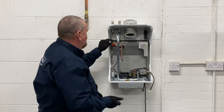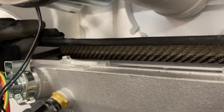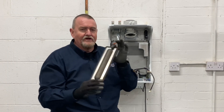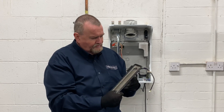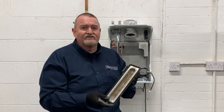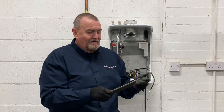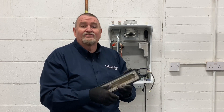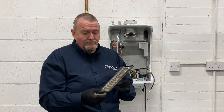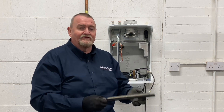The next thing to remove is the burner. There's a little rubber flap which is part of the burner seal on the left-hand side. We just lift that up and ease the burner out. This is a mesh burner, very easy to clean — just give it a brush over. You can rinse them out if they get really mucked up, but in my experience they don't get very dirty. This rubber seal is elastomeric silicon rubber, which means it's very flexible and is only changed when necessary. Unlike some manufacturers where if you break the seal you have to replace it, this particular one can last a number of years. Just have a good look and make sure it's not showing any signs of damage.